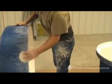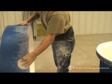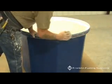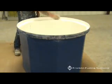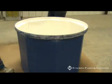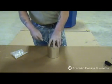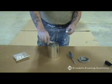Surface Preparation: Sand down the area in 4-inch tall segments on the two components being fiberglassed together, removing the blue color and getting down to the glass fibers. The fiberglass sump should be sanded using a power sander with a coarse green core 40-grit sandpaper. If sanding by hand, use an abrasive medium to make a rough surface for the fiberglass to bond to. Remove dust created by the abrasion process with a tack rag, then wipe the abraded area with acetone to help the mat adhere to the abraded areas.